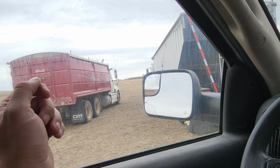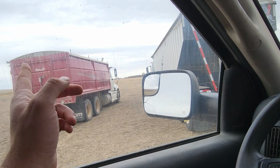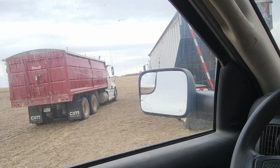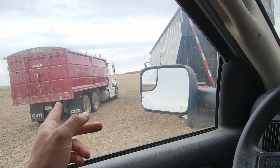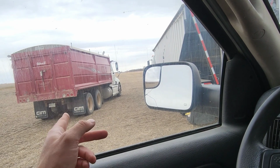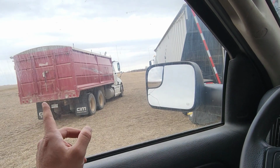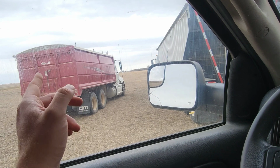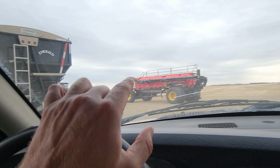So he got 12 ton of fertilizer, and the weight was like 22,100 or something like that. And that shouldn't be, because that truck empty with a full tank of fuel is around 10.8. It's around 10.4 empty. So we figure Dad either misheard the number, or somebody said the wrong number to him, or the scale was not zeroed when he drove on it. One of those 3.